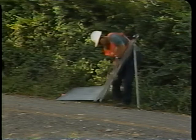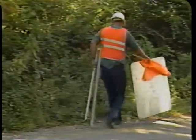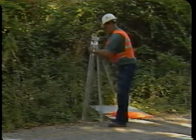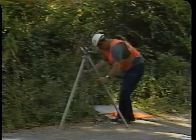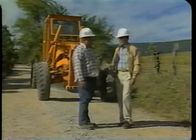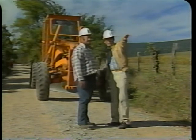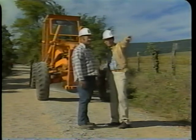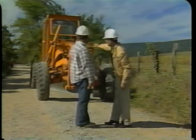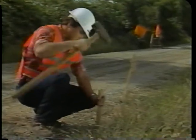Step 1: Place the traffic signs. Follow the same procedures used for smoothing. However, reshaping involves more personnel and equipment than smoothing, so use more caution while directing the work. Step 2: Determine and mark the limits for reshaping. Check the surface for major defects that will cause the road surface to be rough, and check the section where the road has been flattened. Make sure sufficient material remains to restore a smooth surface with the proper crown. Mark where the repair is to begin and end.